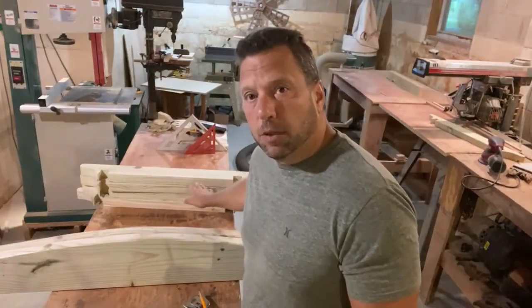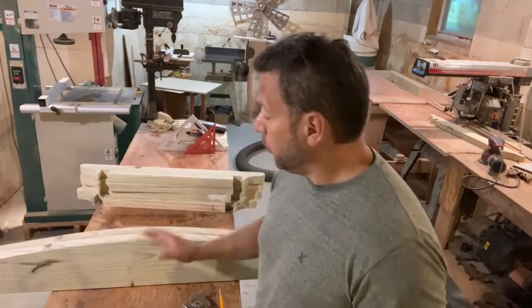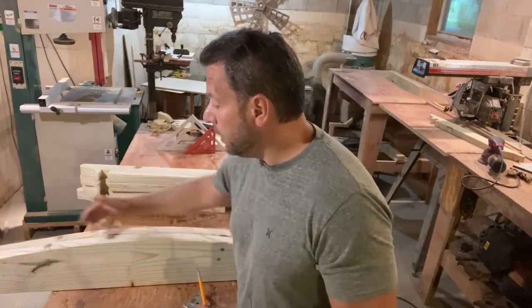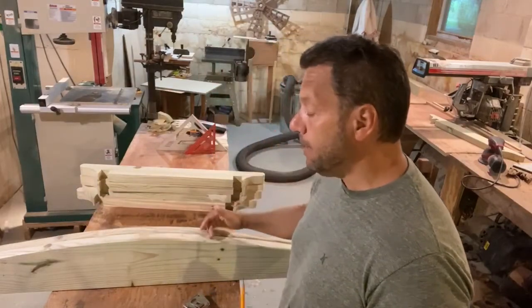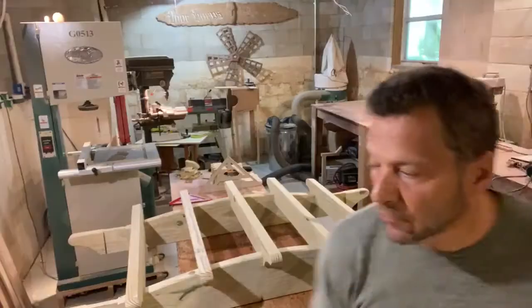With the shade joist complete, the next step is to mark the header for the location of the joist. We do this by finding the center of the header, and then we'll go 9 inches to either side of that, and then again 9 inches. Here you can see we've marked the on-center locations as well as the width of the joist. This gives us some registration marks to make sure that we keep the joist well aligned.